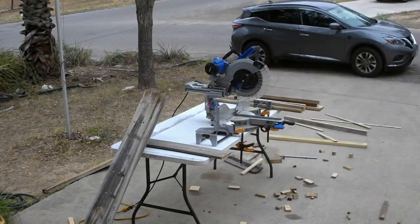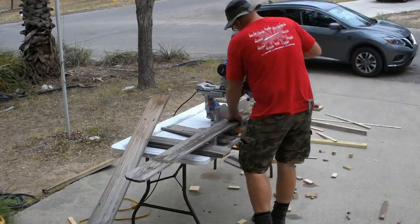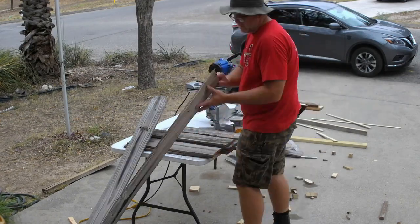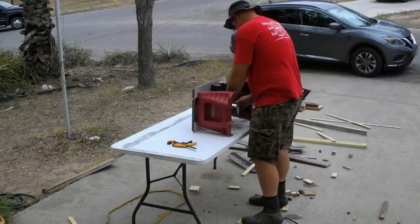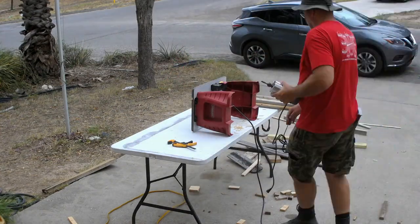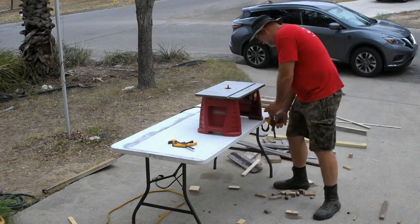I cut off the parts not suited to my project and tossed them in the scrap pile while I used my first cut to mark the rest. I cut ten boards, which was enough to wrap around the back half of the tractor to provide shade for the rabbits. Next I set up the router with a straight flush cut bit that I had removed the burned-up bearing from, to hog out the material in preparation for the half lap joints I planned to use for the outer frame.